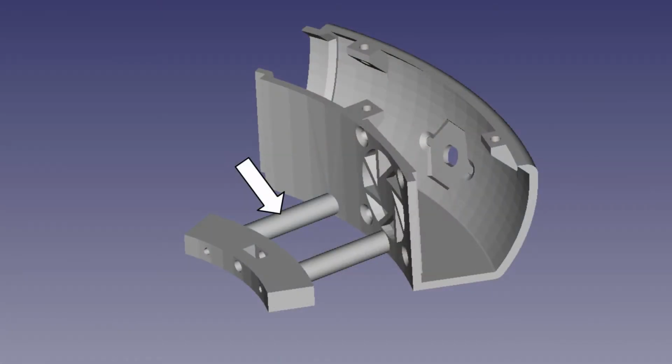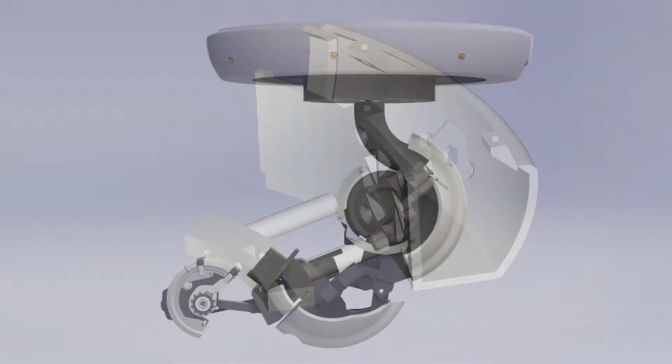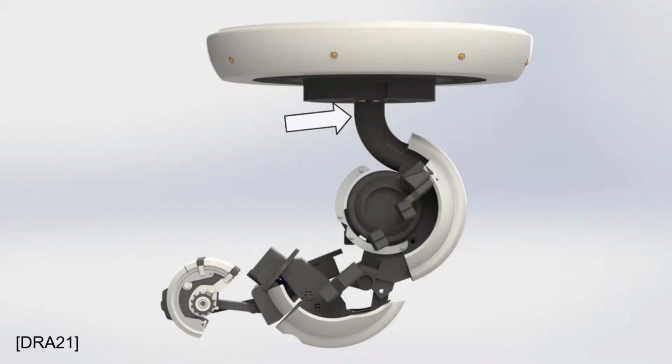The small tubes between the channels and the cylinder function as a mounting point and cable channels at the same time. Note that the small cable channels might need to be drilled out in order to be able to feed cables through. These channels will later house LEDs, and I used them also to contain the required electronics for power. The channels are designed to be used as cooling ducts for the LEDs by mounting 2 40mm fans in the design slots. The servo in the cylinder is connected to a main pivot tube.